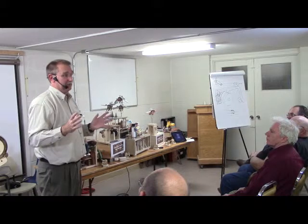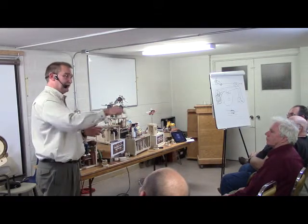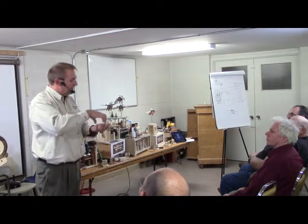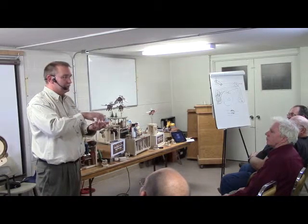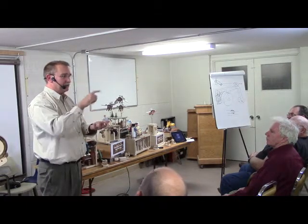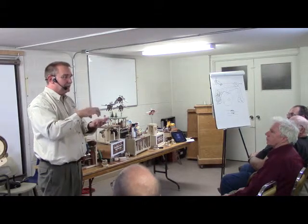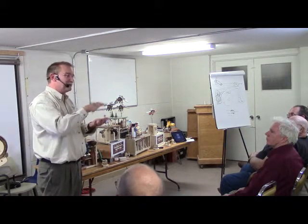Now, I don't have a lathe. So how do I make circles? I make them like all you guys do. I cut the circle out a 1/16th bigger than the paper template, and I go to my disc sander and sand it to the line. Very seldom do I have an outside diameter that really matters. I mean, a cam, yeah, I might sand a cam a little bit, but you know what? It's not the world's end if it's not perfectly smooth, because usually something's moving anyways.